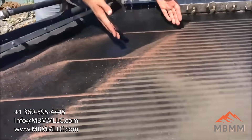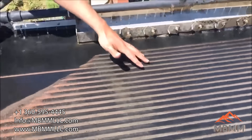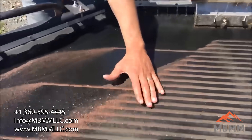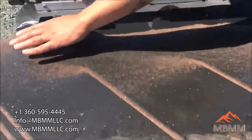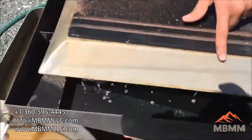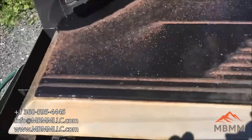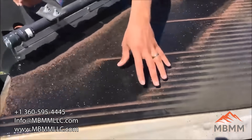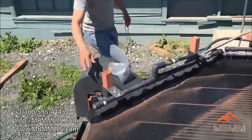I stopped the table so you can get kind of a snapshot here of where the copper goes. The copper comes across the top grooves here, makes a fan down, and then works its way up the table this way. The number one and number two ports are almost pure metal, and the number three middlings will capture anything that overflows into the third port. This can be rerun back onto the table if you're getting a little bit of copper and sand mixed together.